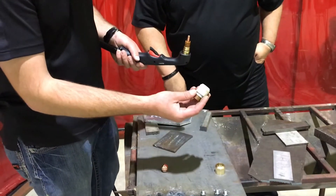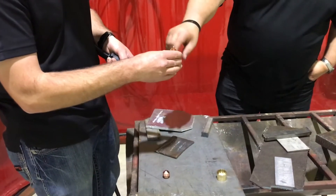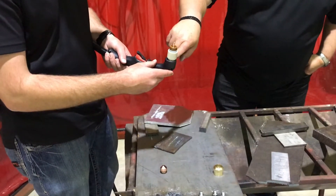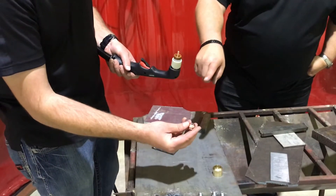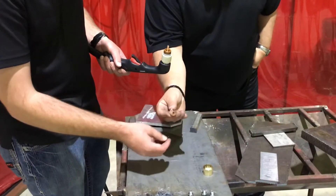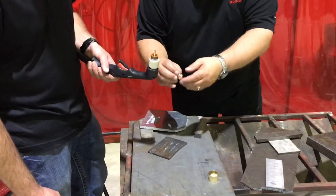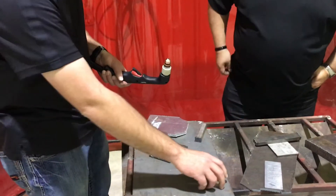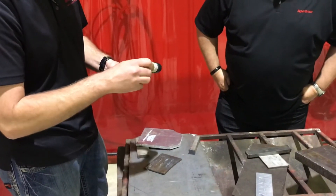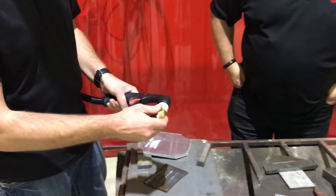Then you have what's called an inner retaining cap, and that's what holds those parts in place but also has a rotor, or an up-and-down safety switch, that goes to actuate the safety circuit in the torch. And then you have what's the magic of the whole setup — this is the nozzle shield combination, in which the flat spot on the bottom that you see here is what would ride on top of your metal, and this is what sends the arc down at a 45 degree angle so it can get that special angle. Andrew is putting it into the torch at the angle you might use on a hand system, and then the outer retaining cap holds it all in place and tightens it down so the safety circuit is actuated.